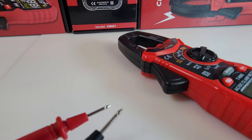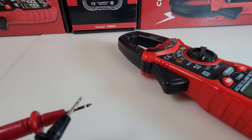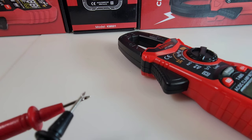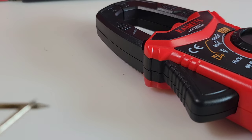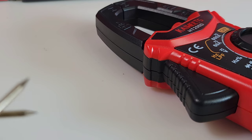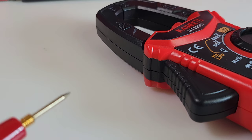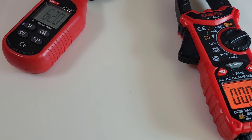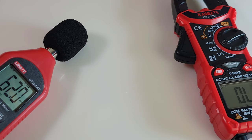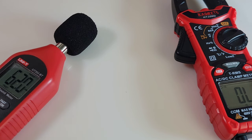It's continuity time. Testing with the default test leads — it's a little slow, it is latched, and not that loud. Let's try the Probe Masters — definitely faster. Still not the greatest out there; I'll give that about a six and a half, maybe seven out of ten. Maximum output volume in continuity is 62 decibels — on the low side. One thing noticed with the Probe Masters: when you have continuity connected the light stays on, but it takes a long time to illuminate — it's a good feature visually, but just takes too long.